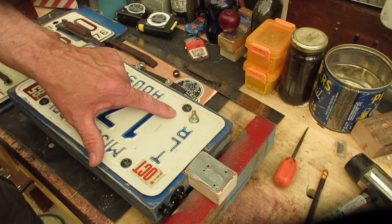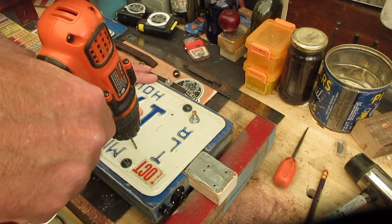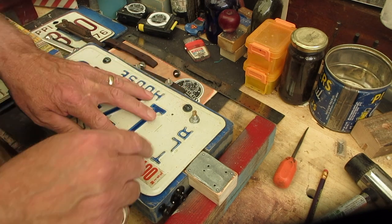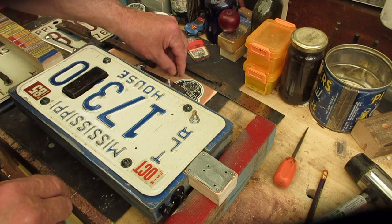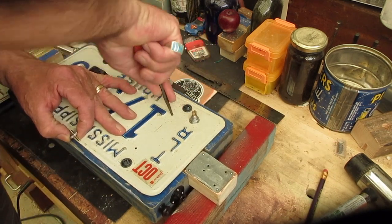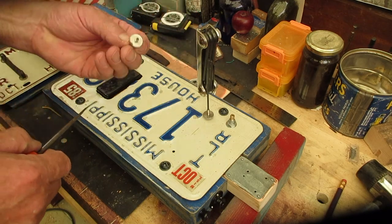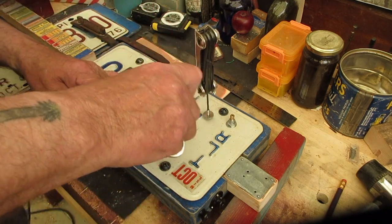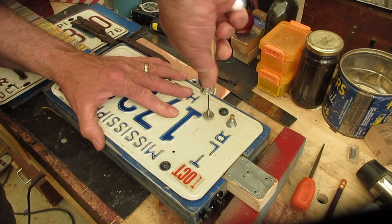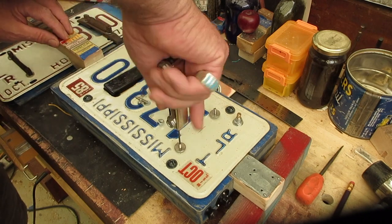I took the drill and went through down a little bit where I made my awl marks. Now I'm just going to run this through - one, two. When you go through this way there's going to be some shards at the other side of the hole - you don't want them. Now it's time to just screw this in. If it's a little bit tight, you can take your awl and wiggle it around a little bit until it will thread down in there tightly. You can tell when you've got the right match for the hole - just a little bit of wiggling. When you set that post on there you will literally have to screw it in; it will thread in, it'll be fairly tight. Make sure you don't strip those out. Running the second one down - nice and solid.